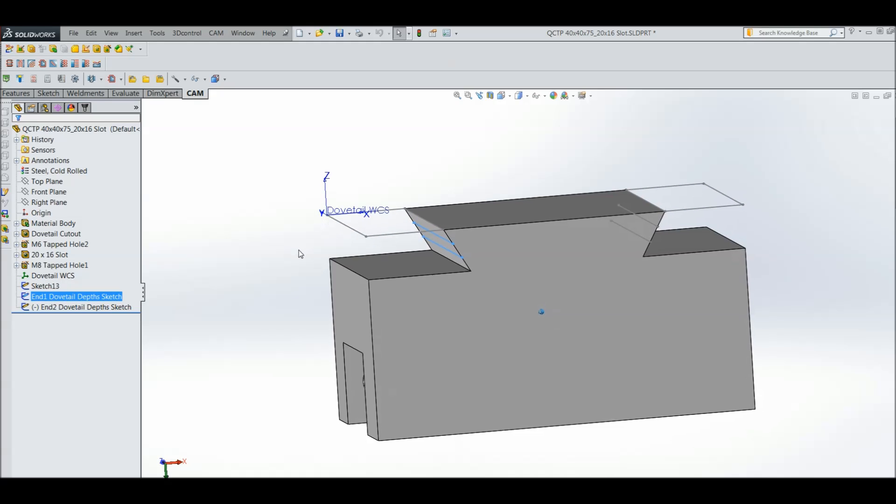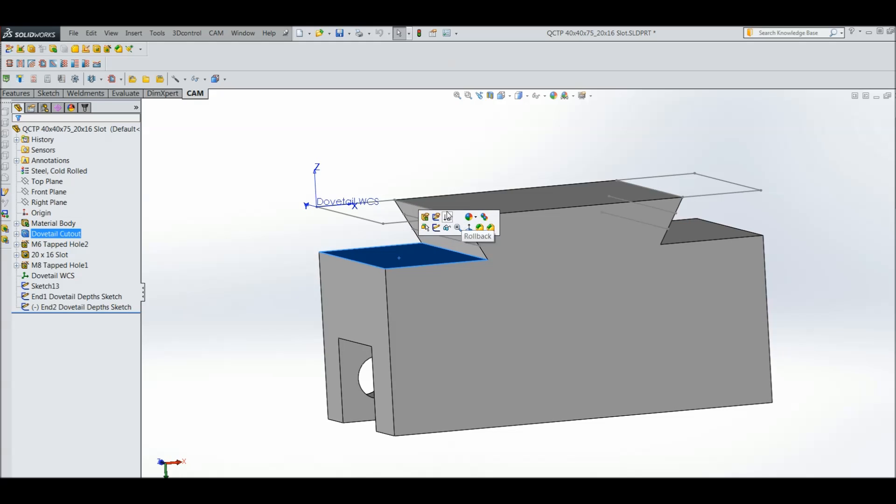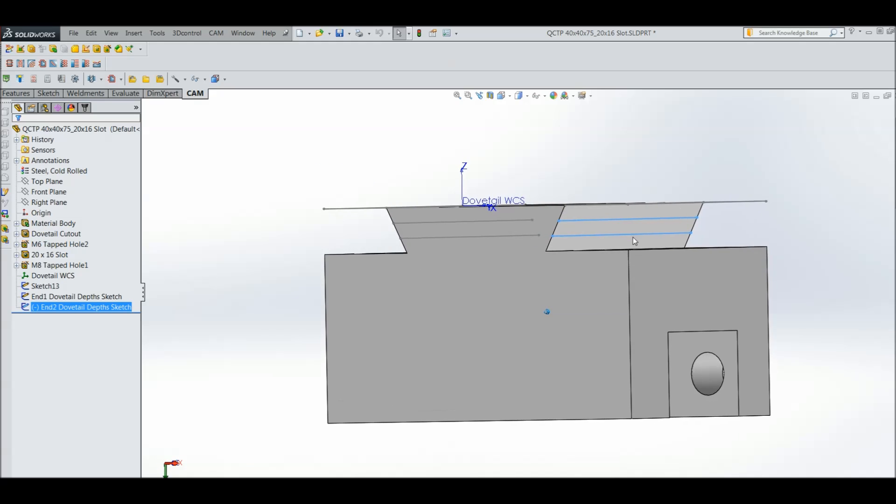This is the way I've done it. I've put a sketch on each of these faces - this one and the one on the opposite side - that defines the three different depths at which the dovetail is going to be cut. There's one roughing cut with six cuts at a 0.33mm step over. Down here is the second depth where it repeats that with eleven sideways cuts. And then the final depth is done at the finishing plane. So the dovetails are cut in three sections with the final one doing the finish cut. Around the other side it's exactly the same arrangement.